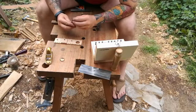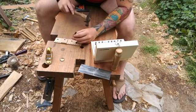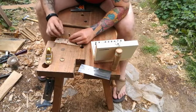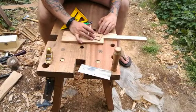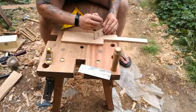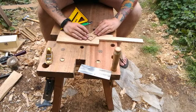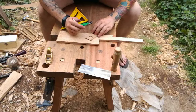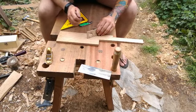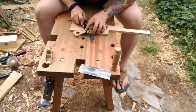I'm just punching some numbers — it didn't really work out too great. It became apparent that the wood I'd selected, which was kiln-dried oak, was really dry and it wasn't a good choice; some air-dried beech would have been perfect for this, but it serves a purpose. I'm just marking out for the angle finder — this is exactly the same principle as a speed square. I'm scoring the wood for the set angles that I use quite often.